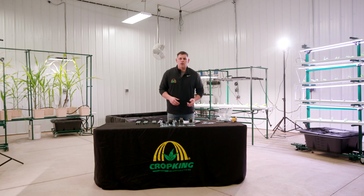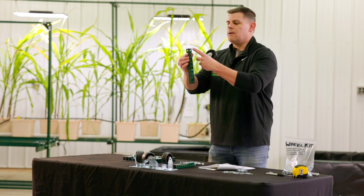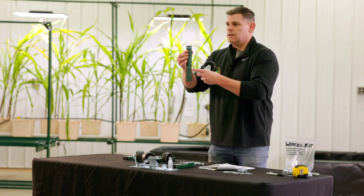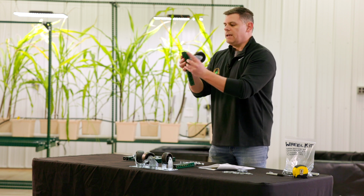We're now ready to install one of our casters onto our 2 pieces of support frame. Choose any one of the casters and make sure that the long edge of the caster is parallel to your piece of steel and that the short edge runs perpendicular. So they're going to align like this.